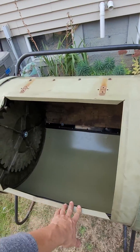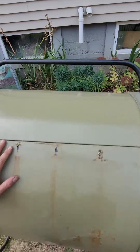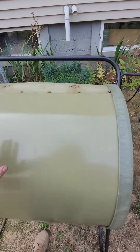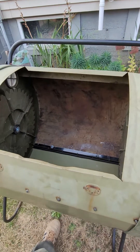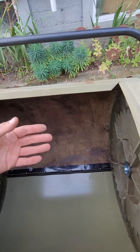Getting it off the ground and contained is important to me. I had to replace one of these panels — specifically where they joined, they were rusted completely through. It could have continued functioning for a while, but the replacement panel was like 50 bucks, so I took the two existing panels, cut them, overlapped them so they fit, and then put a piece of plastic in this spot where there were holes on the exterior to mitigate water leakage.